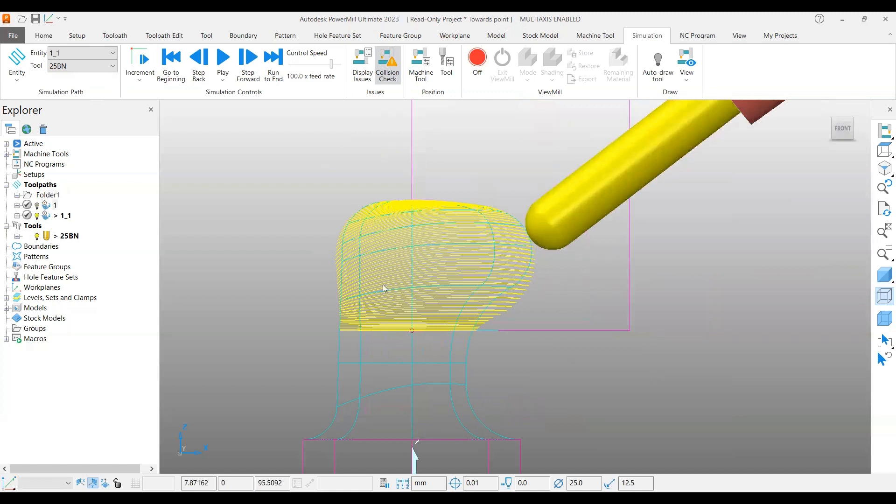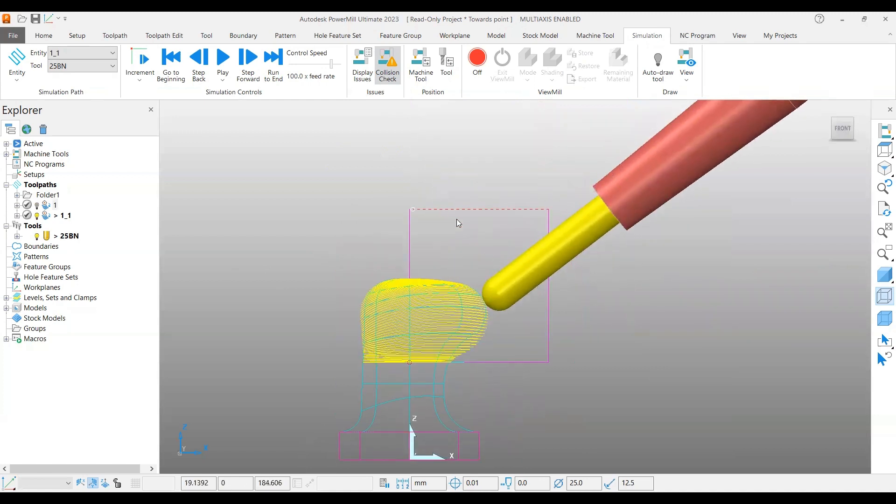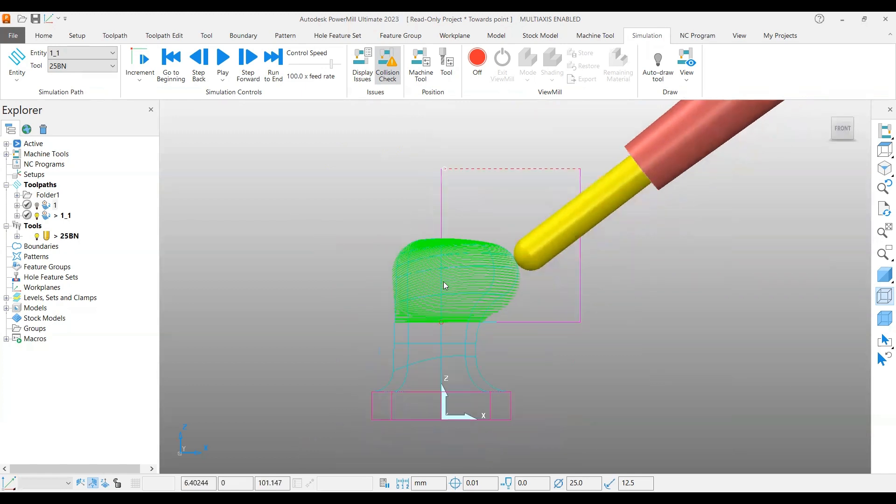There are some differences between the two points — 50mm and 70mm. You can control the tool axis using the tool axis page and the coordinate system, whether 0, 0, 50 or 0, 0, 70, whatever you have given. At the same time, you can use a surface finishing toolpath as well, as mentioned.